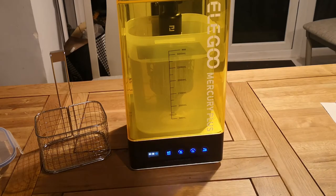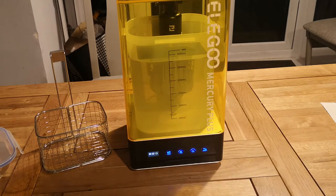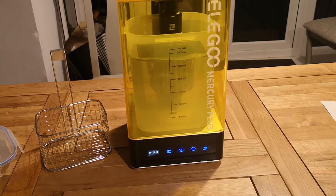So that's finished. I'm going to run it again — two minutes in total for this one. You can set it for as long as you want and just play about with it to see what works for you. I've been a little cautious because it's quite a large print, but a minute will do for most models. Comment below — how long do you usually put it on to wash your models for? I'd be really curious about that. You want to make sure all the leftover resin is off the model, but you also don't want to leave it in IPA too long, so it's kind of a fine line to get that perfect wash.